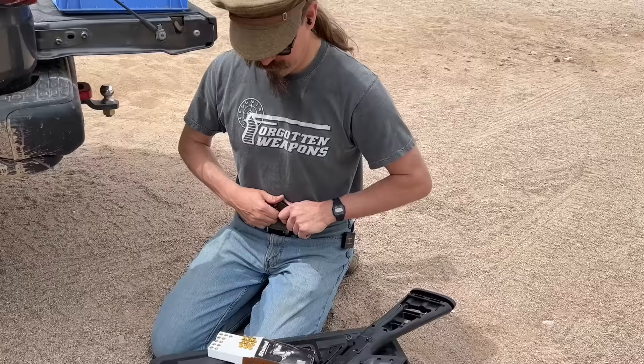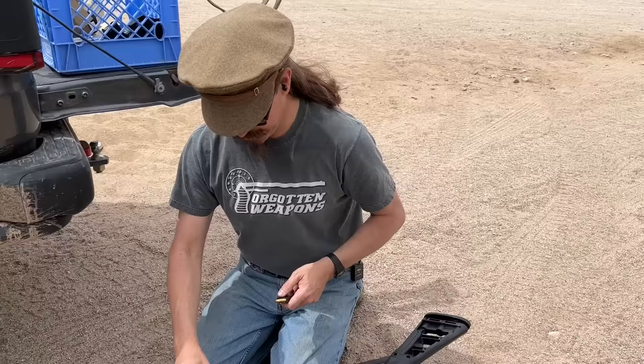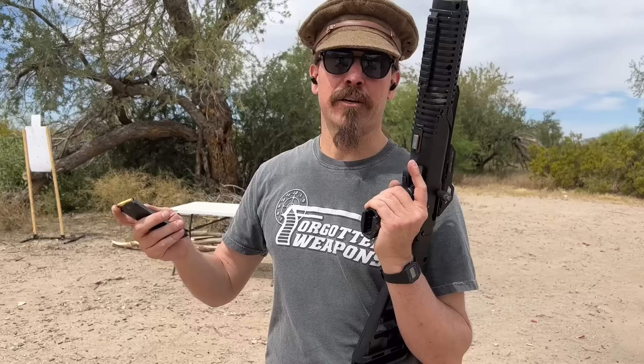I guess we should try it in that instead. Yes, I do have a box of .30 Super Carry. Let's see if it runs in that cartridge as well. So .30 Super Carry, which is what they actually chambered this thing for, is essentially geometrically almost identical to 7.65 French. It's a millimeter longer of a case, which means you can't put .30 into a 7.65 French pistol. Which is important because .30 Super Carry is a substantially higher pressure round than the original French pistol cartridge, so you don't want to run this in a 1935 pistol.